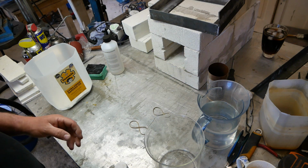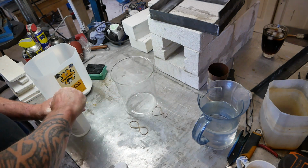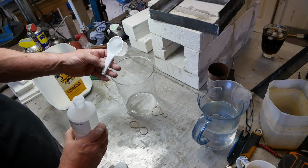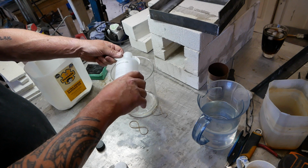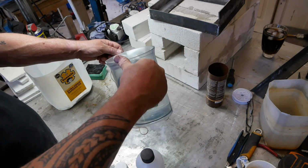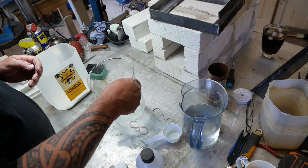the liquid to make the paste is going to be made up of liquid sodium silicate. I don't want to put that much in. How am I going to measure that? Well, I'll probably use the same spoon, actually. So that's 50-50 with water. This actually is an 80 ml measure, so I'll put 2 of those in. Oh, let's make it 3. I can't imagine I'll be using this stuff all that often. Again, this came from the pottery supply company. And I'll put 3 of water. There. I'll mix that up.